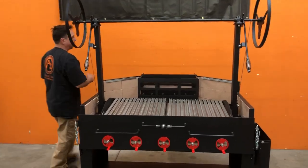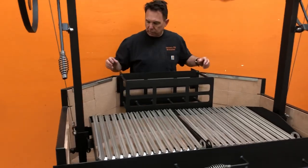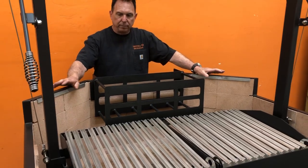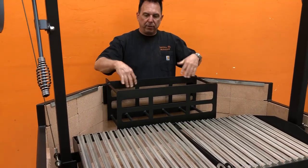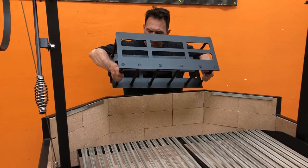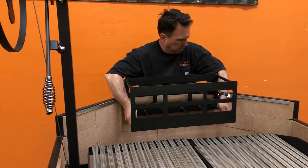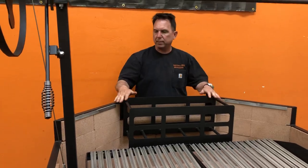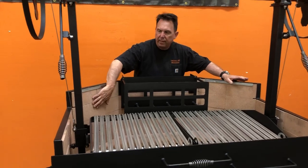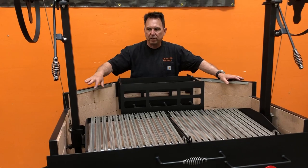So we'll go back here to the rosette. Like I was talking about, it's suspended in midair, so there's nothing supporting it — it has to rest on this back apron plate here. If you want to take it out, lifting it from the top is really difficult. But if you lift it from down below right here and give it a little tug up, it comes right out. If you want to put it back in, just line it back up over the firebrick and it drops right back in place. These pieces of angle iron here that you see are just wedged in there to keep the brick in — that's basically for shipping. Once you've got it, you can pull these pieces out and just leave it nice and clean.